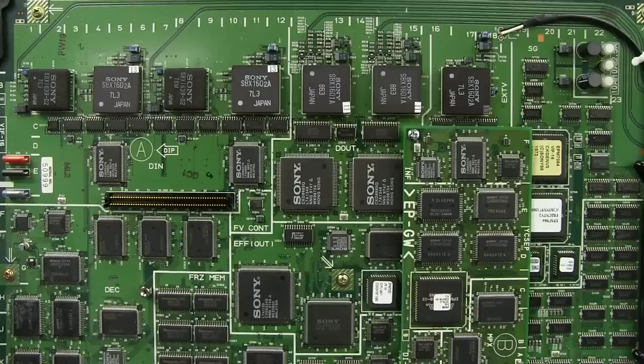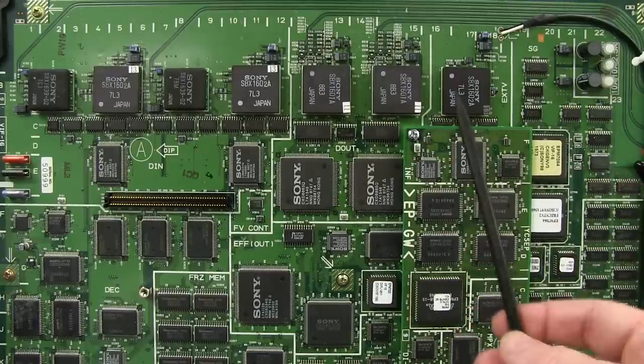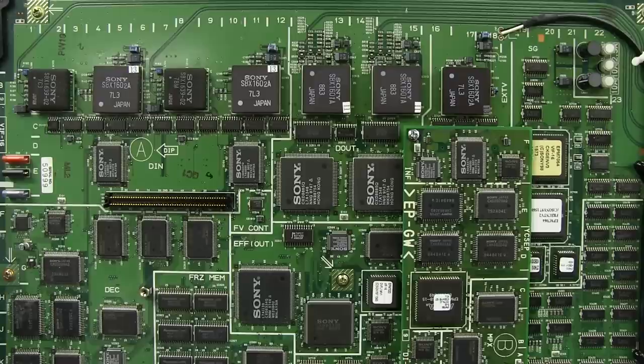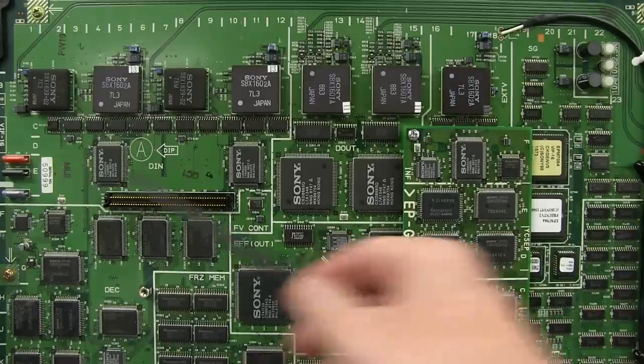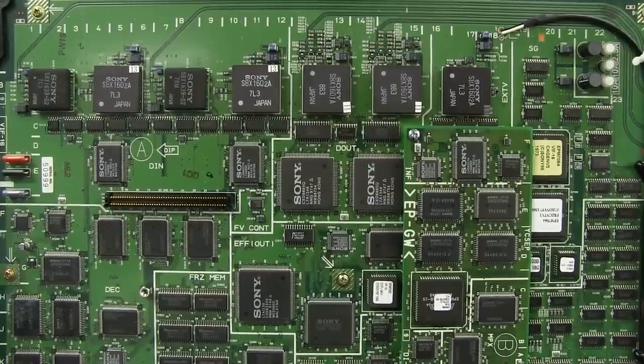That'd be my guess. And given that this is the main I/O board, of course, you'd expect this to be where the DACs and ADCs are. There's high quality 10-bit DACs and ADCs to sample the video signal and to output it, reconvert it from the digital back into the analog. But I can't find any sort of analog devices part or anything like that. All custom Sony part numbered. Pain in the ass. So yeah, sorry, I can't really show you anything unless I go through and Google every single part number again. You can do that to your heart's content because the high-res photos are up on the website EEVblog.com, so you can just check them out and try and find them yourself. If you do, hey, link them in. I'm going to crowdsource it.